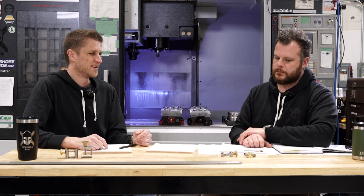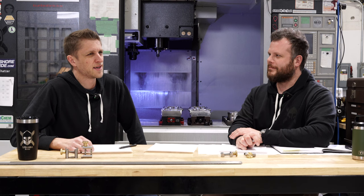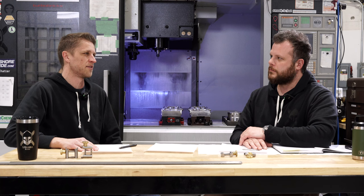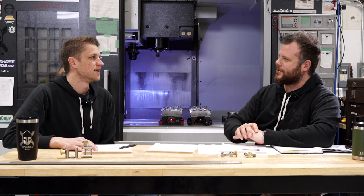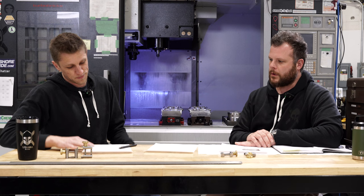The tool holder is still fine. The collet is toast, the end mill's toast, the soft jaw's toast. There's runout on the spindle, but the spindle's still good. The machine moved a little bit so I have to realign — I'm still going through the realignment process right now, almost a week later. Slowly, slowly, a little bit at a time. Fusion simulation would have shown this crash — meaning I didn't simulate it. It was an easy thing, just engraving soft material, too much on the plate. Slow down a little bit. Smooth is fast — sometimes you just want to be slow so you can be smooth. Verify, verify, verify.